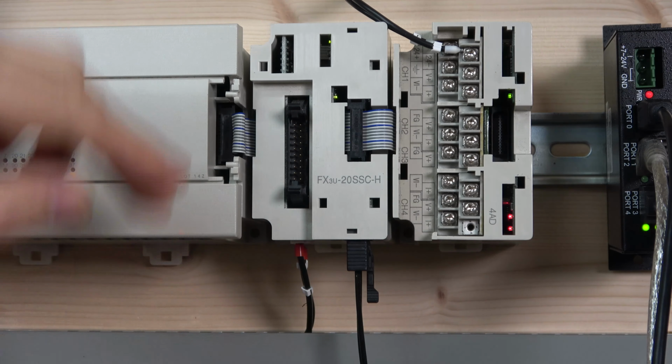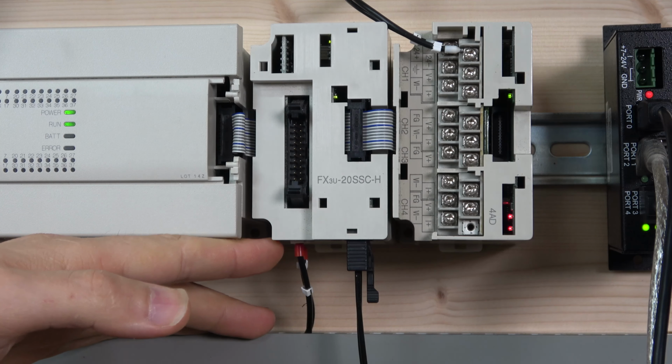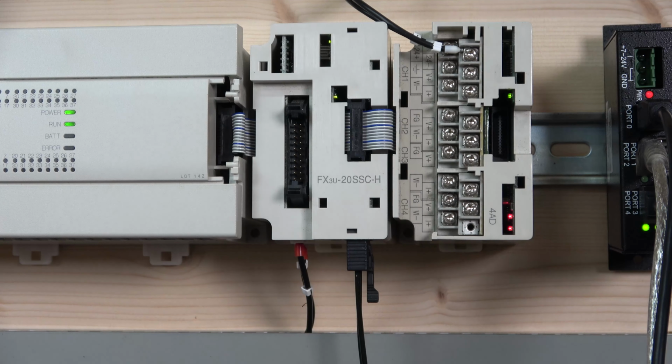Right here in the bottom, this guy does need a 24 volt supply. You do need to have a special plug-in here. You can plug in 24 volt DC supply in there. I have lost my connector, so I had to improvise, and I used two cables with ferrules that I was able to push onto the pins. So there we go, it'll do for now.